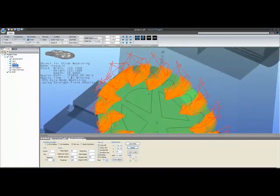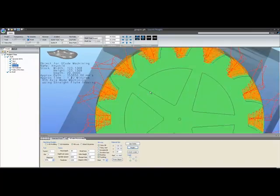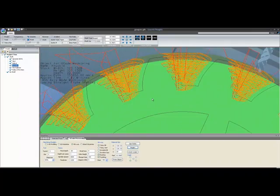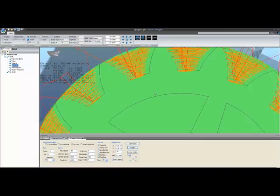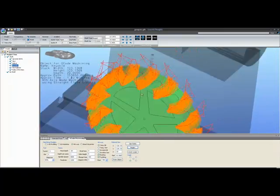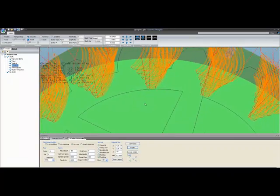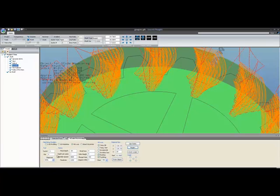They should cut fairly quickly, even though they take a long time to generate in terms of G-code or display on the screen. This toolpath is a very complex one because it has to arc and curve at every point to fit around that blank as it's going, and that's why it takes so long to generate. You'll notice how busy the toolpath is.